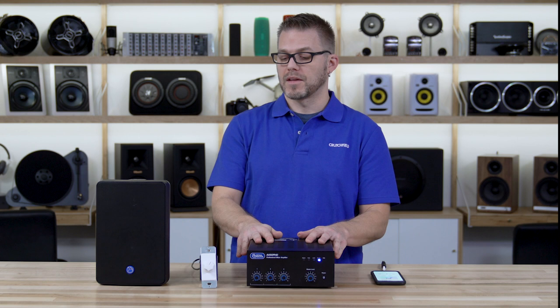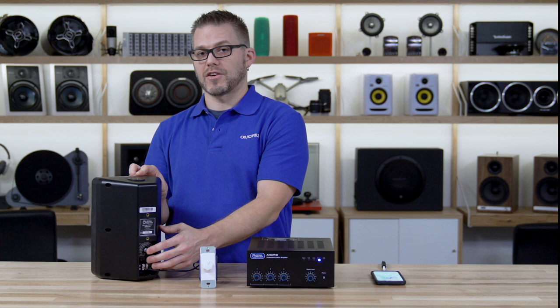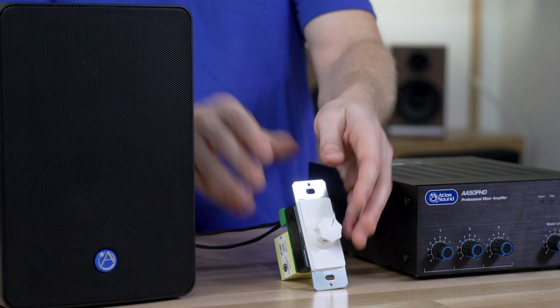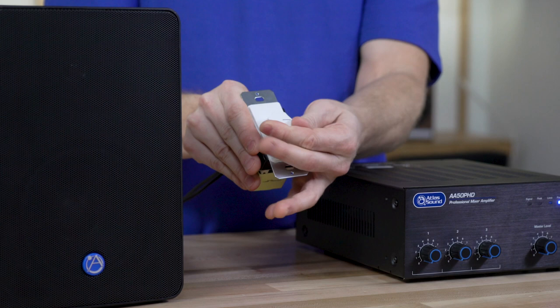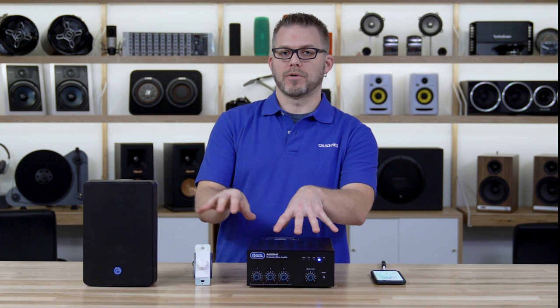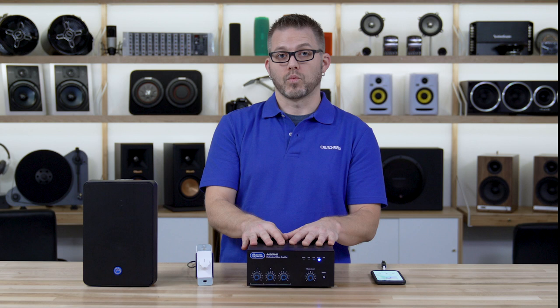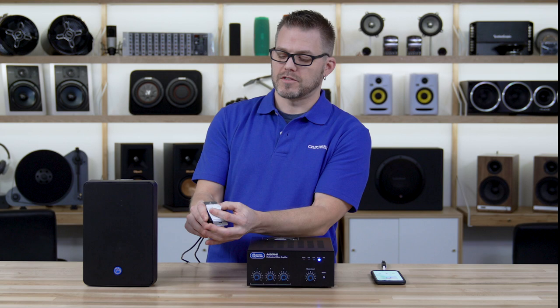Part of that is because you're not thinking about the system as a full piece of equipment that works all together as one unit — you're thinking one piece at a time. What we want to do is have our input gain all the way up to get the cleanest and strongest signal coming into our amplifier. Every position on the AT100 reduces from maximum clean output by three decibels, so we don't think of the output volume as coming from the amplifier itself.